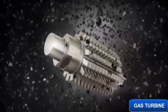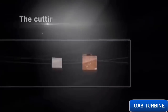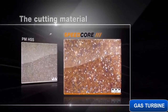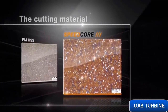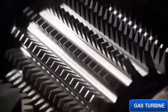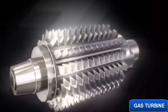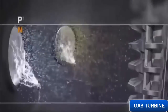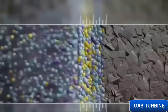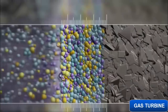The secret of its superior performance: secondary hardening using intermetallic phases. The carbon-free synthesis of iron, cobalt, and molybdenum permits an increase in high-temperature hardness without any loss of strength. The new cutting material is just one component of the Speedcore hob. Its full potential is only realized with the addition of a tailor-made coating: LMT Nanosphere, the world's first nano-composite coating for gear hobs. The coating is built up atom by atom and protects the tool from heat and mechanical strain.